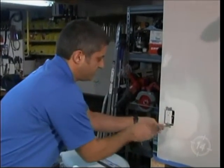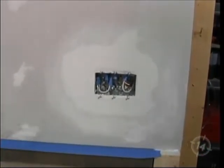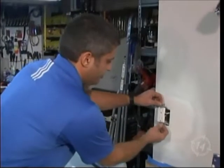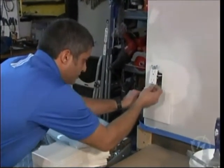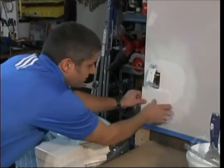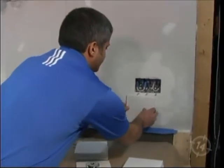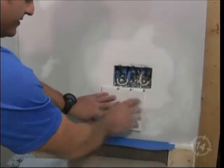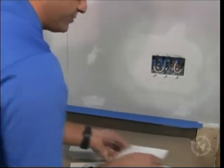There's a second way to do it. If you look at the outlet on the right, that's a three-gang box — in a lot of homes you may have two switches and one outlet. You can keep the outlet intact, install your tile, and make absolutely certain you can get into that screw hole. Another way is to simply leave the screws in. As long as you make sure your tile is up to the right height, the cover plate's going to fit. If you go up too high, you'll have problems and may crack the tile.